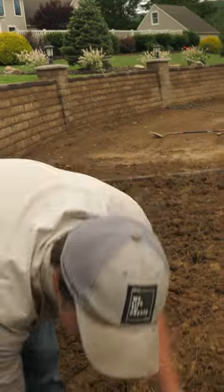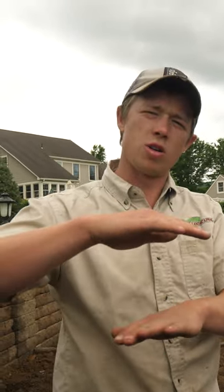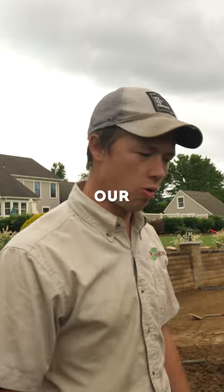Laid out the amount that I needed, spray painted a line around it — that's where I'm gonna dig. These are about nine inches, maybe ten. I think they're nine, but we figured for them. I want at least six inches of gravel on top of them to hide all my plumbing and all that stuff. So you can figure 16 inches below grade when you come to dig the hole for it.